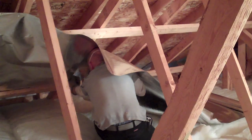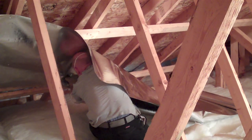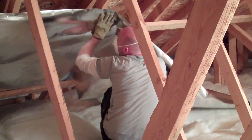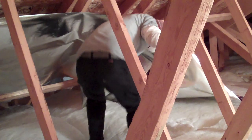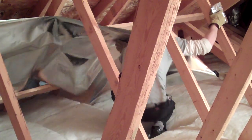For the beginning wing of this attic, we pre-cut the insulation below and brought the material into the attic. Also, this attic has no plywood or leftover boards from the framers to walk on. Cutting pieces of 2x6 or 2x8 at various lengths and bringing them up to walk on will make installation much easier.